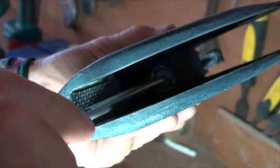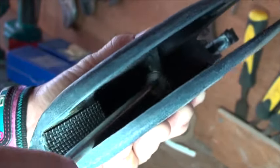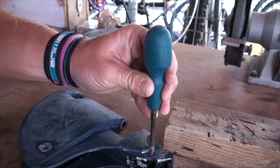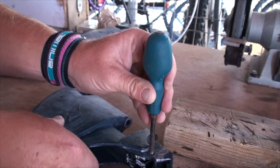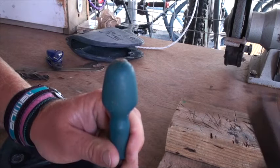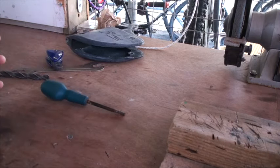Now that it's been removed, the first thing to do is start to remove the plastic screw inside the rudder casting. If you haven't had it out for a while, it's well worth removing all of the parts from the rudder casting so that we can grease them up and make sure they're not going to seize up over time. We're now ready to remove the rudder cam, again using the custom-made tool, just bashing it out here. It's well worth replacing your rudder cams if they are showing signs of wear. We've pretty much got the pin out — careful not to lose it — and then just carefully removing the tool and there's an explosion of parts.